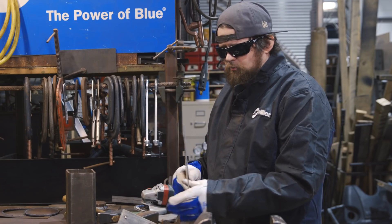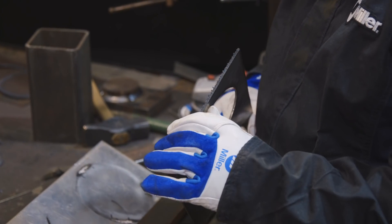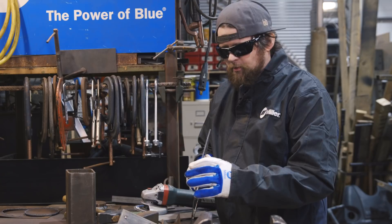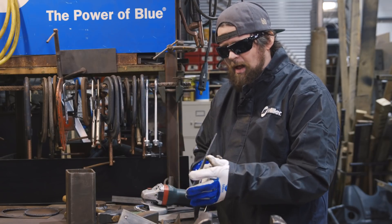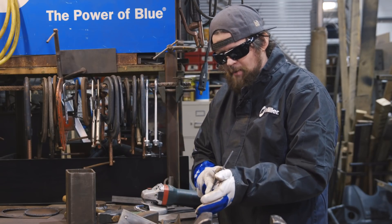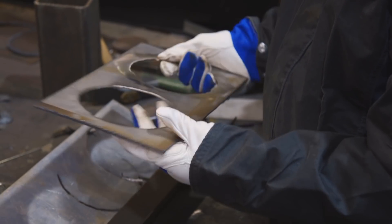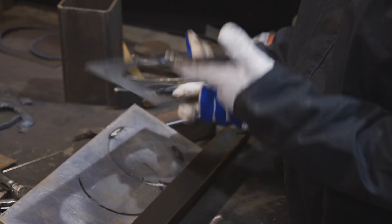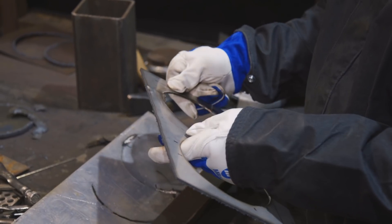You can see the edges are a little bit rough. You get a little sugaring — like you would if you were doing a TIG weld — where the stainless steel surface is exposed to the atmosphere, because that's basically what happens. It gets heated up, exposed to the atmosphere, and has a little reaction. This can be ground off, and in extreme cases it can even be chipped off. It just means you've got to sand it a little bit.